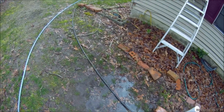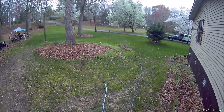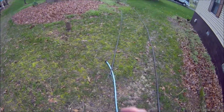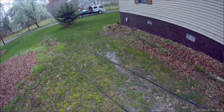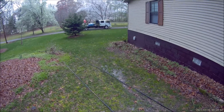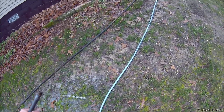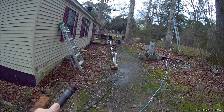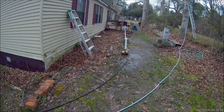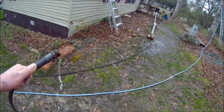We'll give this time for water in that reservoir to flow via gravity all the way down to the end there — and look at this, it is coming out! This water coming out of that pipe — that's no pumping action, that's just water. This is the water coming out of that tank up there and the tank is not under pressure. It's just gravity. And probably if I reach this thing over my head, which would make it higher than the tank, this water would stop.